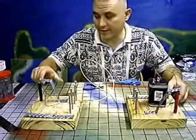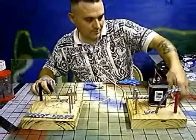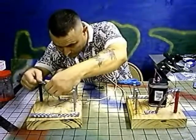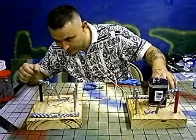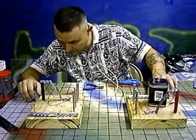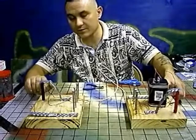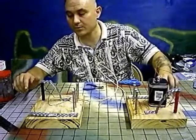Now when I press my key, this side should be attracted down. Let's try it. It's not making a nice snappy noise. There we go. You do have to kind of adjust this just to make sure that it's very close. Now whenever I touch the switch, it's going to cause this coil to create a magnetic field and attract our piece of metal. And now we're ready to tap out some codes.